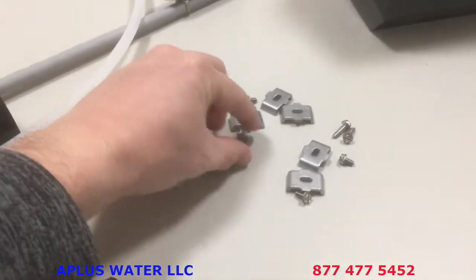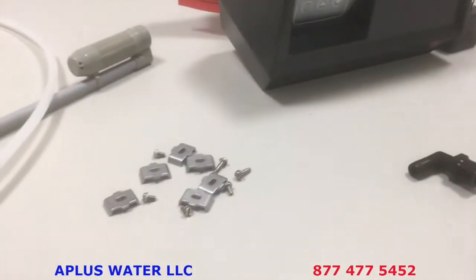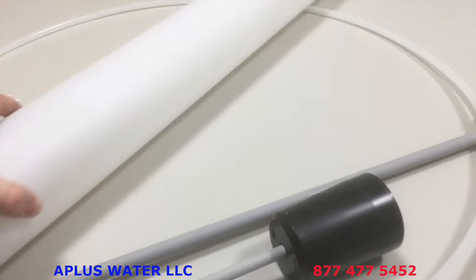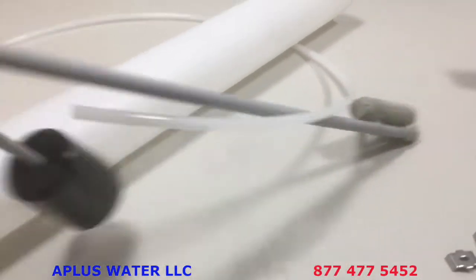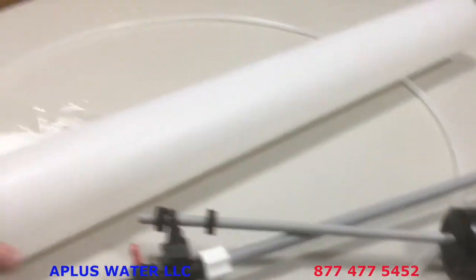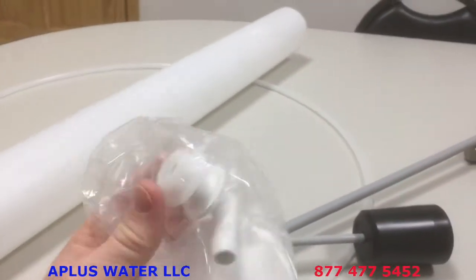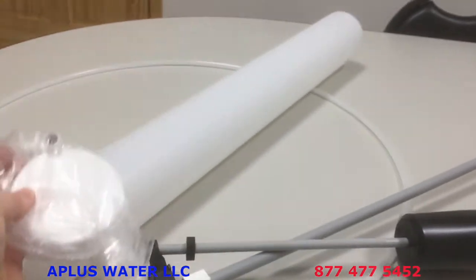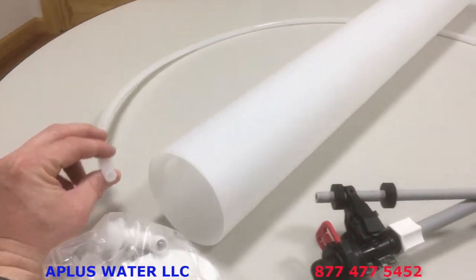You also get a satellite head portion that connects to the two tanks via the crossover tubes. To connect everything we use clips and screws — you should have several of those. There's another set of fittings with the safety float for the brine tank. The safety float has a small pickup at the bottom, a bell-shaped float, and it goes inside the brine tank. You'll also get an overflow elbow, a cap for the brine well, and three-eighths inch tube to connect the valve to the safety float.